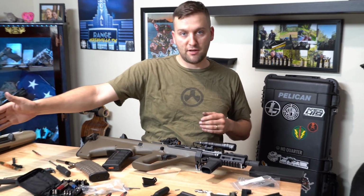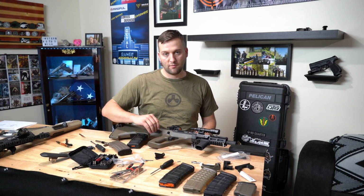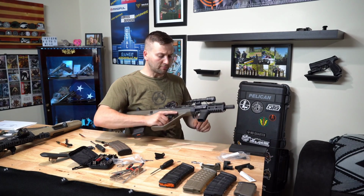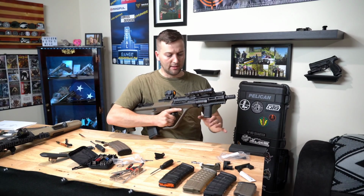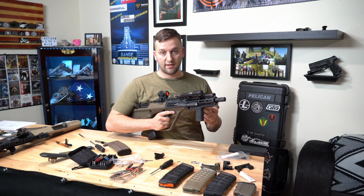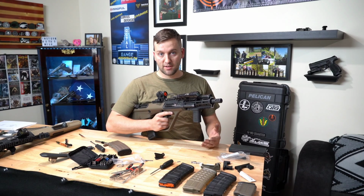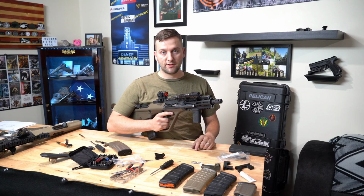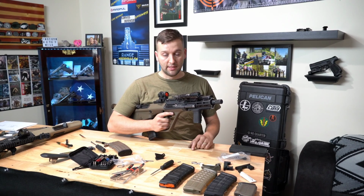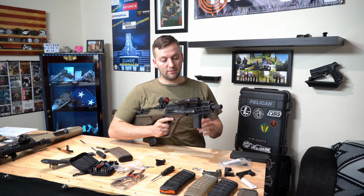That way you can run an iron sight on the forward portion and on the back portion, and they co-witness, and same thing for optics going on that portion. The handguards. Right now we're deliberating whether or not to make handguards out of aluminum or a high-density polymer. The polymer in a mold form would be cheaper to produce in larger quantities and probably offer just as much protection and rigidity for zero devices that go in that portion of the firearm.